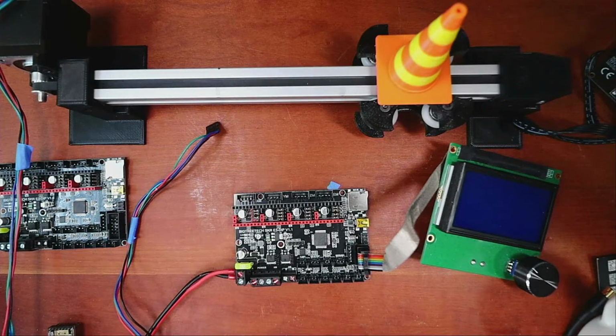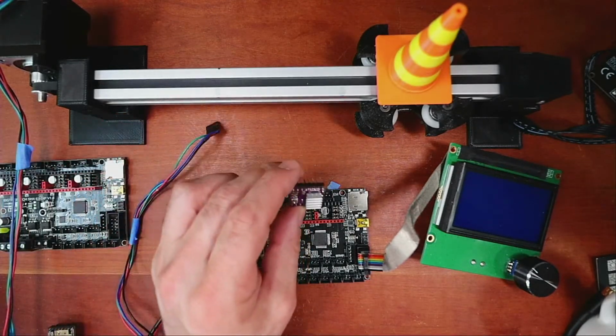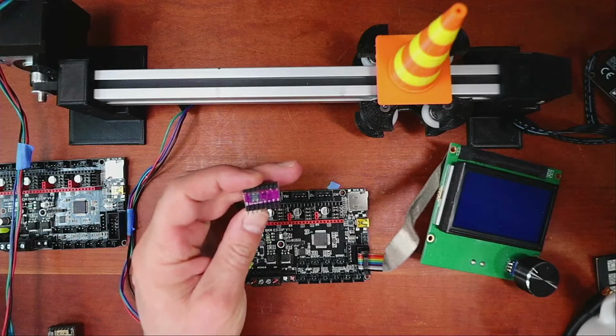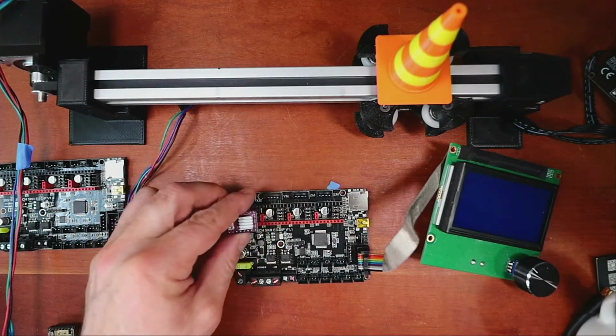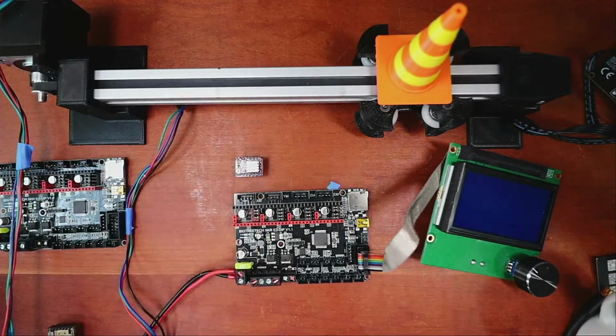So I'm not going to place it in there just yet. Actually, well, no, I didn't find one. So I found a DRV. Now this one you have to look for the enable pin. I know the enable pin's located right here. On the bottom of here it's written EN, which is this pin right here. So if I flip it, I can put it in position. But for now, I gotta check the pinout diagram real quick because I get nervous when I move too quick.